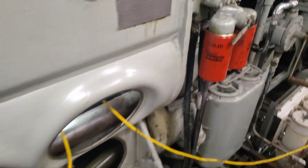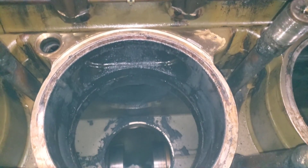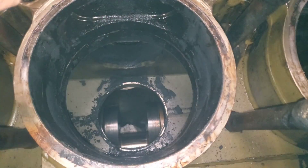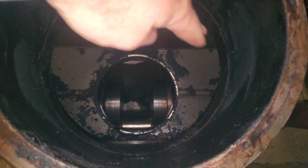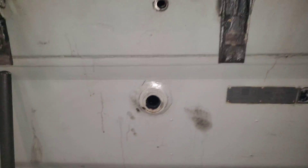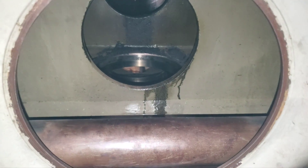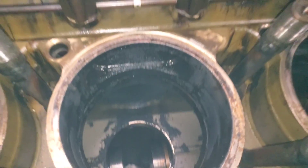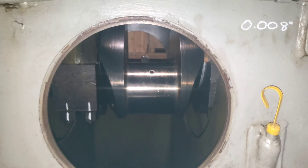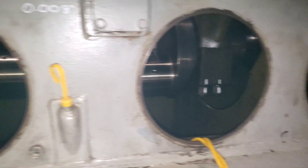It's a lot of bearings in these engines that have upwards of or even more than a hundred thousand hours on them. Here's a better look down inside a bore. This top section is where the liner rides. There's your exhaust trunk going right up to the headers and back to the turbo. Down here this cavity is the airbox, pressurized by the turbo — which you guys saw in the last video. It also crosses over to the airbox on the other side of the V. If we go back up and look down, you can see straight down to the crank. There's your airbox and crankcase — you can see the mains are still in place. They're checked, they're fine. This crank still needs to be polished.